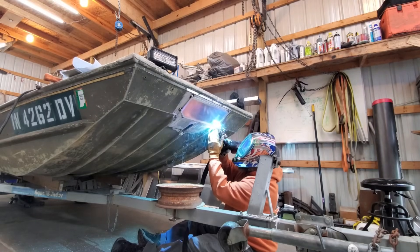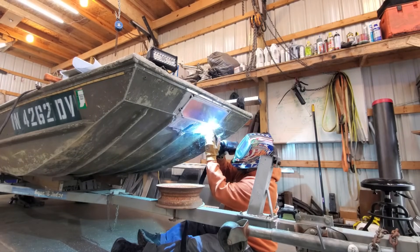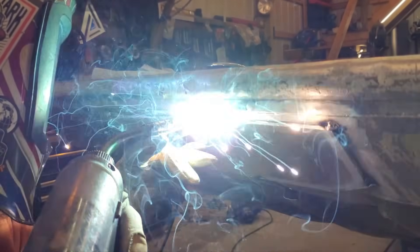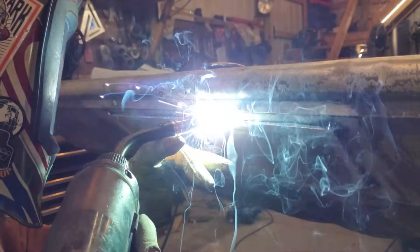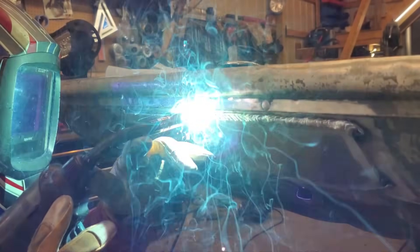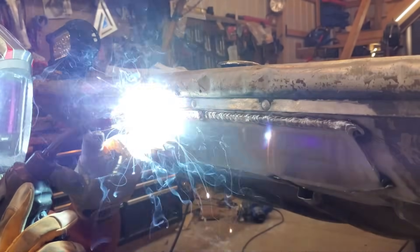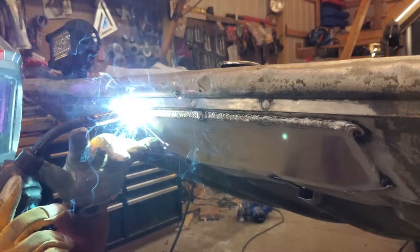I was pushing at about 15 degrees, using gravity in my bead profile. Since we're almost overhead, my gun angle was nearly zero — right in the throat of the part. I wasn't just holding still and moving; I was using a little whip technique. In my experience, when welding thick plate to thinner material, a little whip is much better because you get less penetration and it's easier to get wet toes. It lets the heat dissipate around the weld puddle.